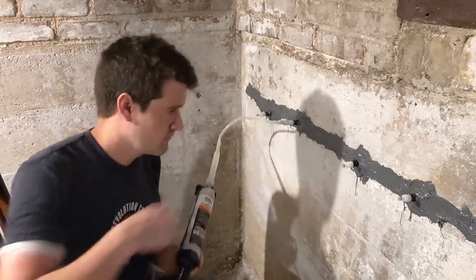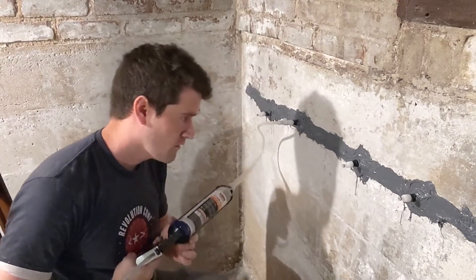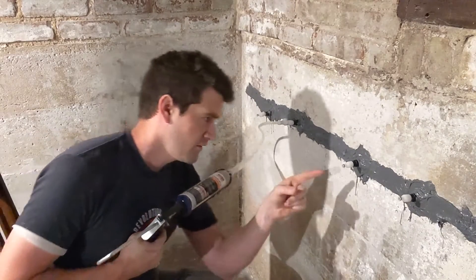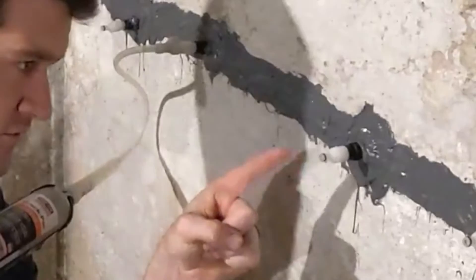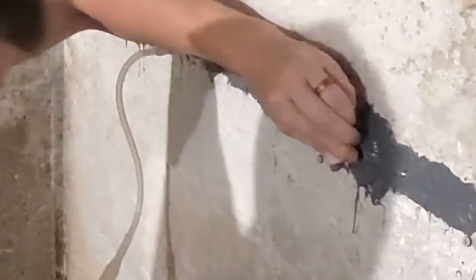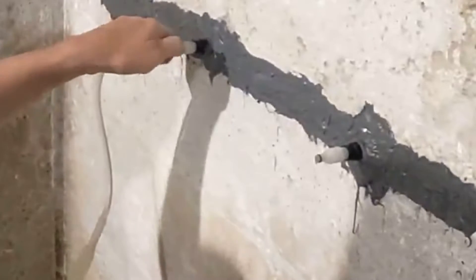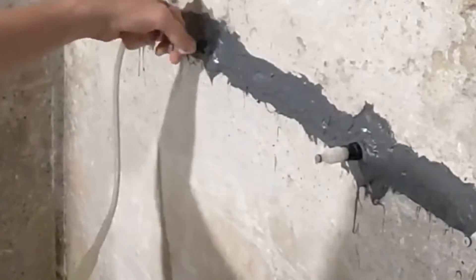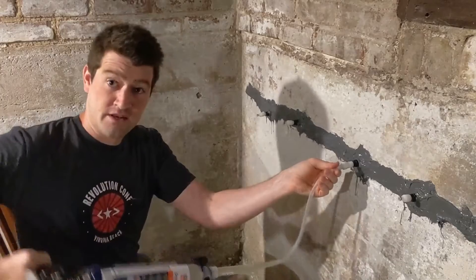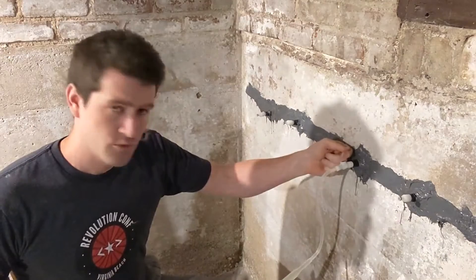Oh, look at that — I just saw liquid in there. Probably one more squeeze. Our patience paid off. The liquid is now coming out of the next port — it just dripped out. So I'm gonna close it by pulling on it. Now what we do is take the hose out of this port and close it, hook it into the next one and push it down. Now we're gonna inject the epoxy into the port that the liquid just flowed out of.